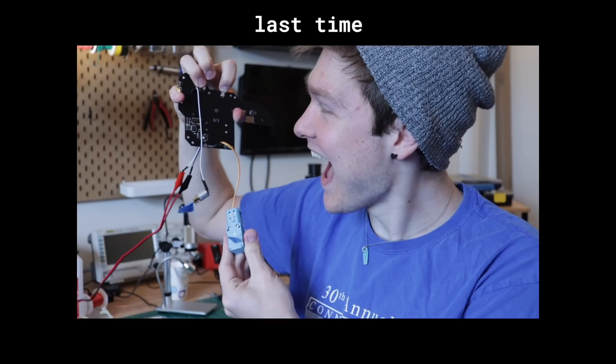Hello my goblins and ghouls. My name is Steven and today we're diving into the mechanics of the next pass of the feeder. Last time we got this brand new feeder board spun up — it's super fancy because it has support for two motors: one to drive the tape forward and another to peel the film off actively so that the parts are free to be picked by the nozzle. It got spun up working well with a new microcontroller, so super stoked about that.